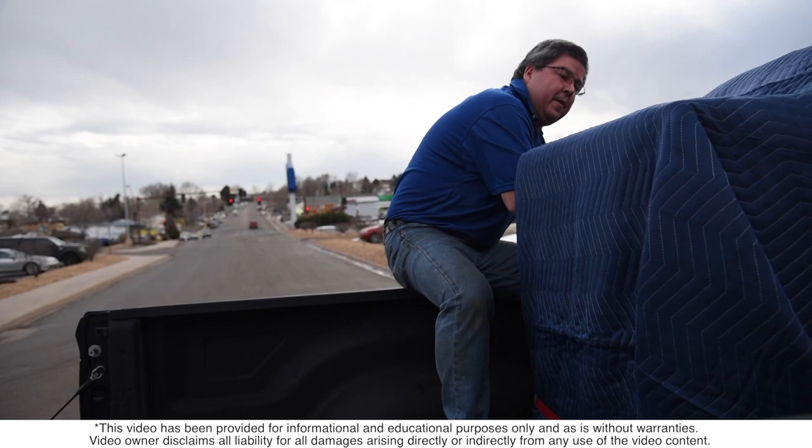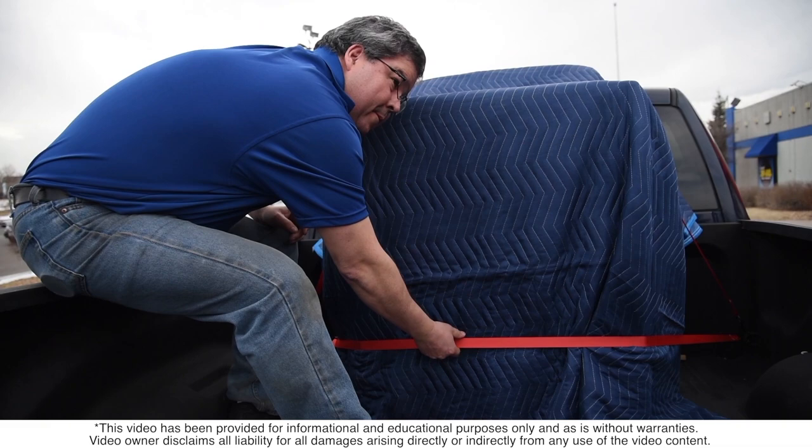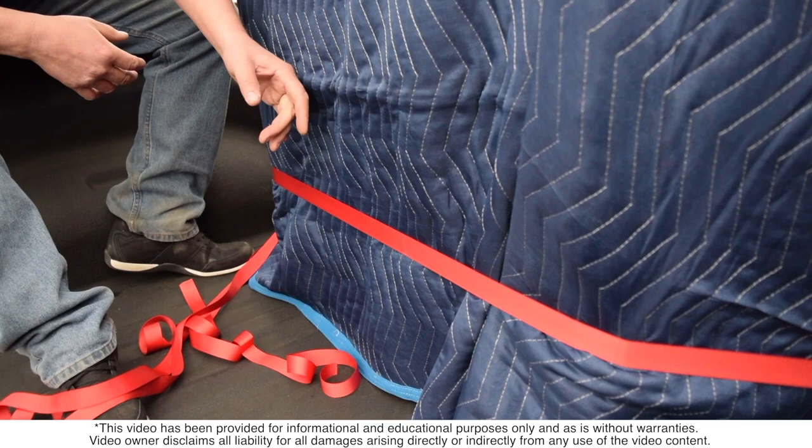Take it snug — pull all the slack out of the blanket. What you're looking for is that you can still get your fingers in there, so there's still a little room and the machine won't get squished. If you can't get your fingers in, you are way too tight and there's a good chance you're going to bend the machine. You want it tight, but not so tight that you can't get your fingers in.